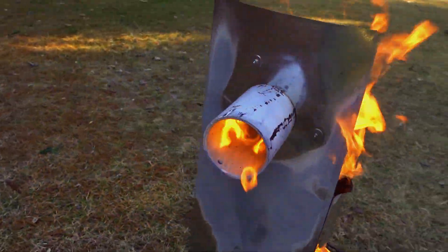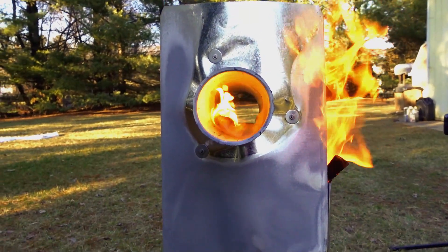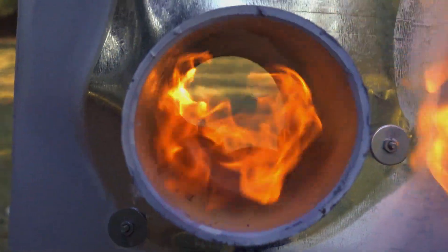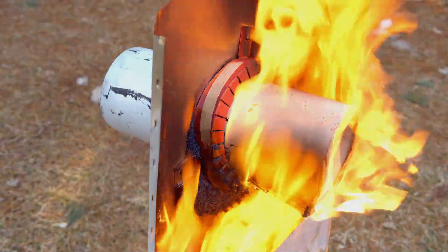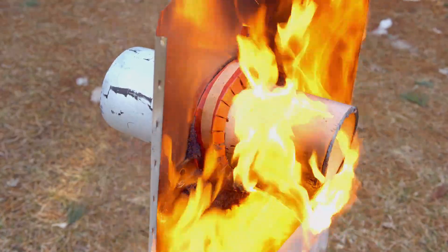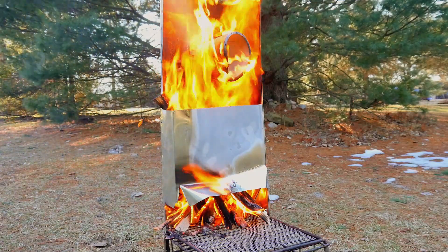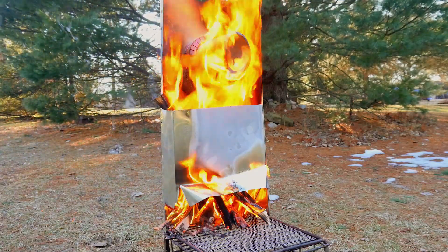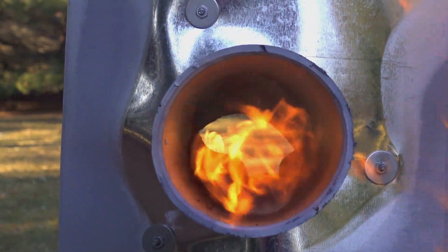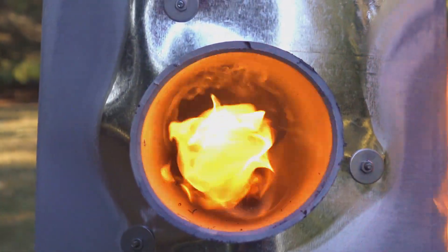On the bright side, the collar is starting to crush the pipe inward — that's pretty cool to see. The fire warming the plastic to allow this sort of deformation is probably necessary for this effect. On the front side, a lot of the expanding graphite has blown out the side of the collar, probably because the sheet metal I used to mount this to is fairly thin and was easily distorted by the pressure. For those who asked in my last video if expanding graphite exerts pressure, here's your answer. Most of the closing-off effect is focused on the bottom of the pipe, unsurprisingly, because that's where the heat is mostly coming from.